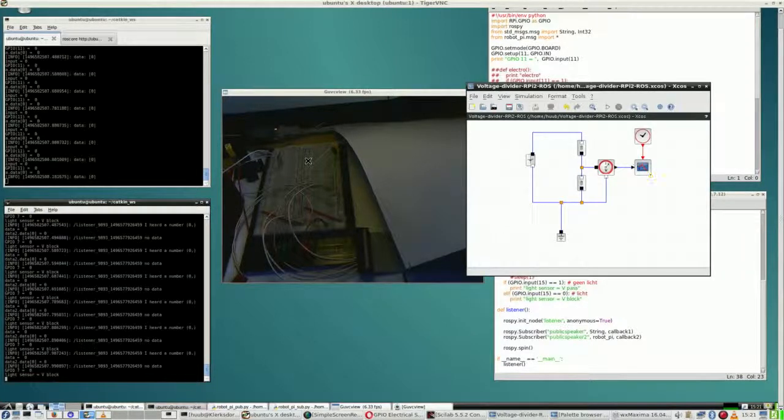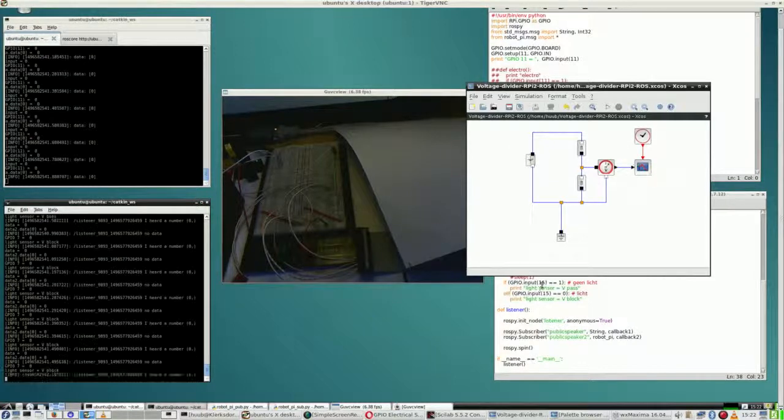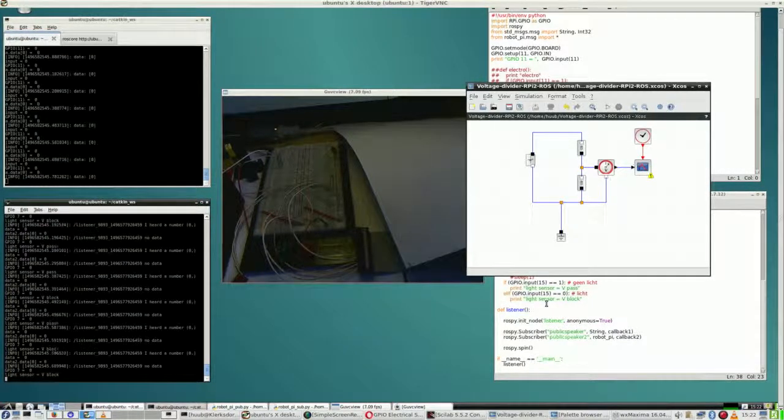Another choice would be the LDR, but that requires an analog to digital converter, since the GPIO is digital and the output of an LDR is analog, and I still haven't found a nice LDR. So what does that leave me? Apart from having a broken port, I am not quite sure now. I want to go on with ROS, but I need to have something done. I will find something, hopefully before next time,